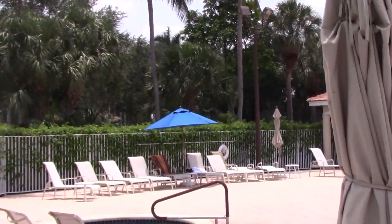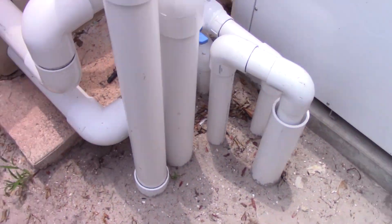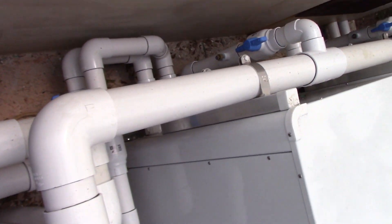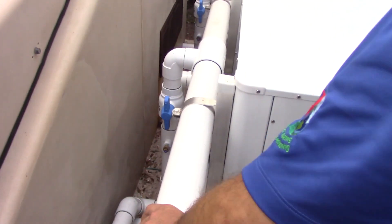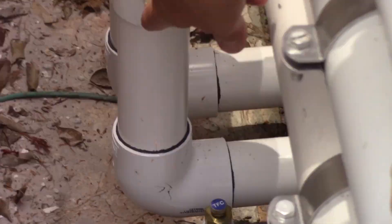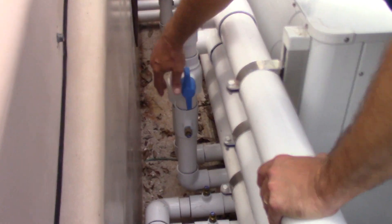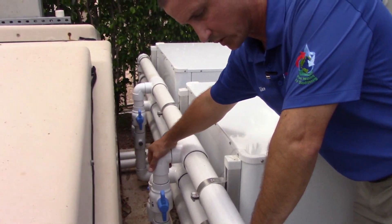Take a look back here at some of our header work. We do really good plumbing — we have exceptional plumbers at Symbiont Service who do a really neat job with all the headers, new isolation valves, and PT ports. These PT ports allow us to check temperatures of incoming and outgoing water in and out of the system on both source and pool side. The isolation valves let us isolate individual units and turn water flow off to them as needed.